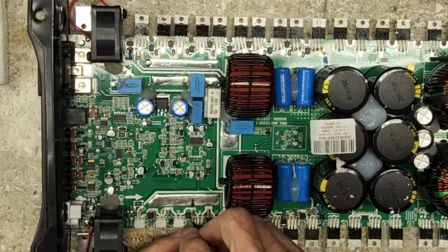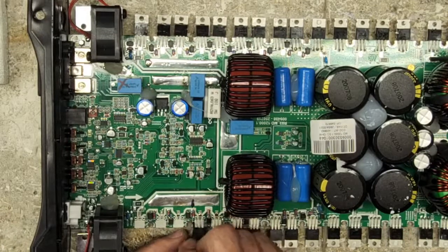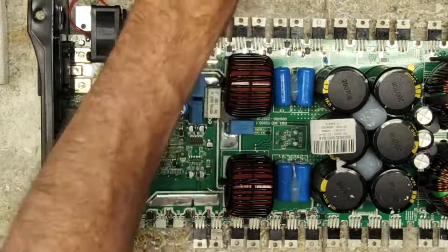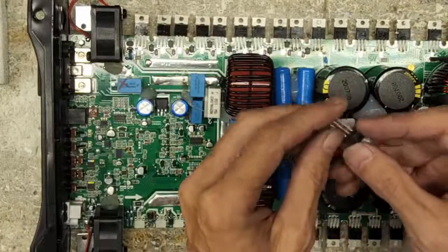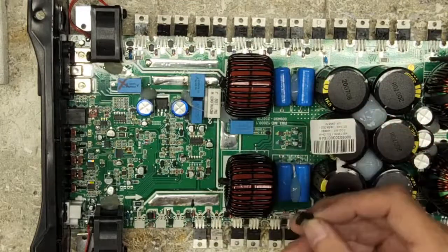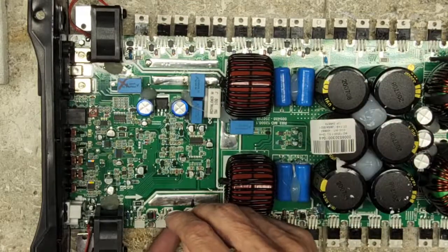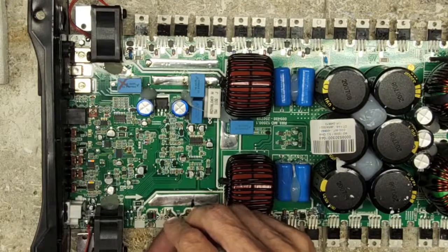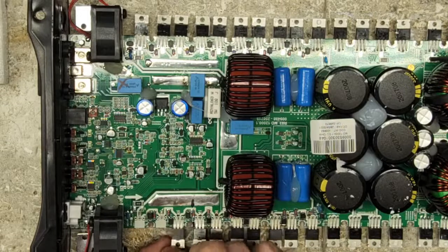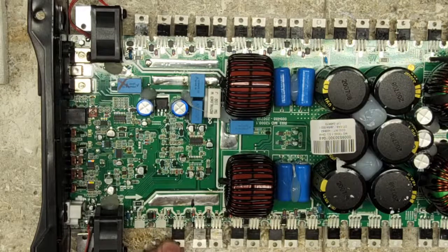And again, with these transistors, they spread the legs out just a little bit on their boards. So the three legs actually tend to spread apart. But if you take the transistor and just slightly stick it into the vias and just bend it over a little bit, you will bend those legs into the perfect shape that has the least amount of stress on them.